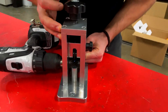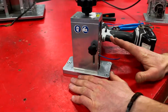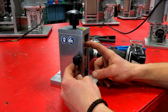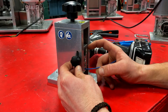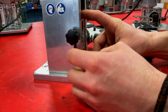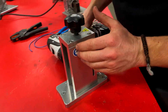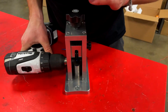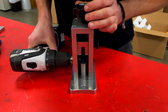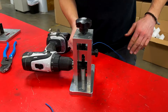Touch your knife off, and then get your wire guide set. Now setting the wire guide when you're using really small cable is a little more tricky because you can actually distort the cable if you push it down too far. But the same rule still applies — you want that 15-degree angle going in and a little bit of pressure on top. Now the last step is to set your knife height. Run the machine slowly and bring the knife down until you start to see copper. Just like that, the machine is all set and we can start stripping.